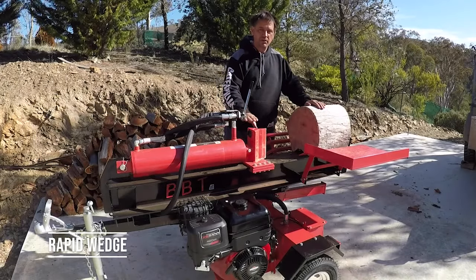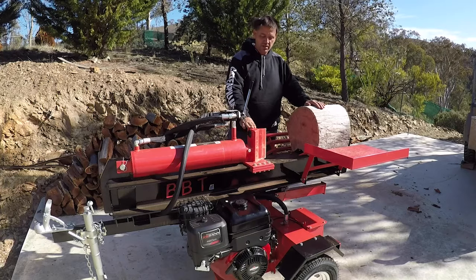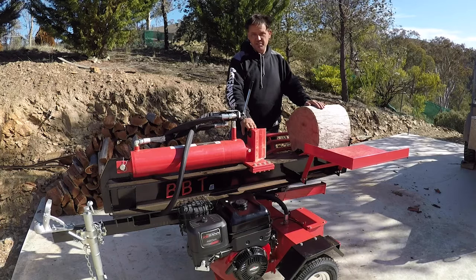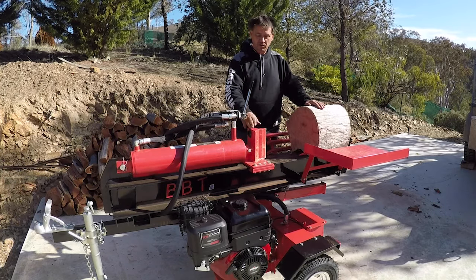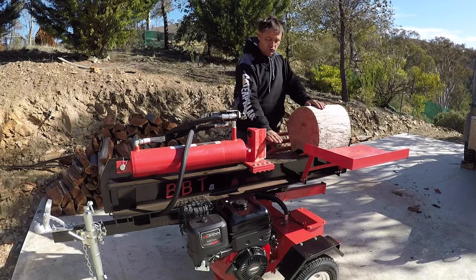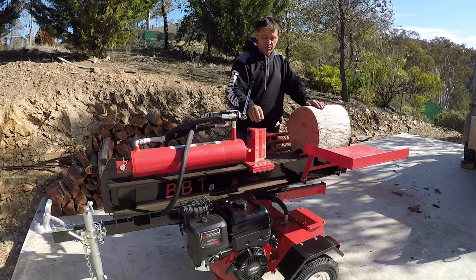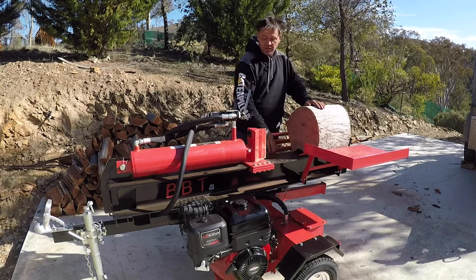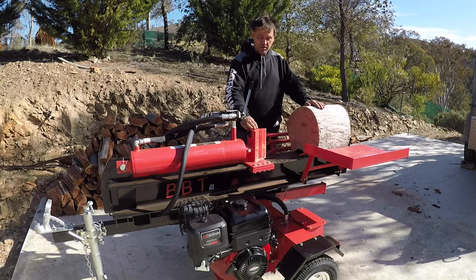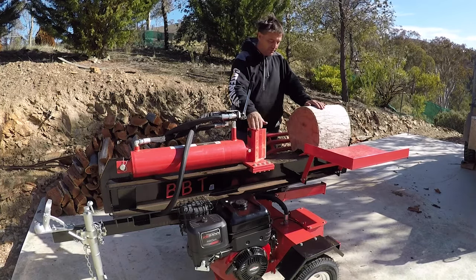The splitting wedge is very important. One thing they like to emphasize is: don't use a cross wedge on a splitter this big, especially on a fixed wedge. As everyone knows, Australian hardwood is hard and varied in grain. If you get one of those wedges caught, it's got nowhere to go — so between your cross wedge and your beam, something's going to give. Generally it's the beam or your cross wedge. If something goes sideways, it goes out sideways and there's nothing you can damage out here.